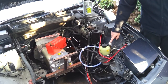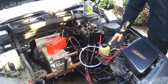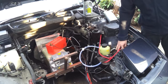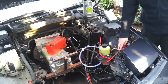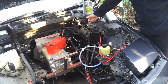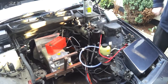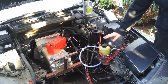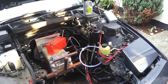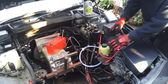I've also got a hydraulic pressure gauge that goes up to about 1600 psi on the high pressure port of the pump, so we'll be able to see exactly what's going on from a pressure perspective. I'm using standard hydraulic fittings and hydraulic flexible hose to bring the hydraulic fluid under pressure into the distribution block. The fitting into the block is 16 millimeter, so we've got a 16mm to 3/8 BSP fitting in there with a copper washer. So I'm going to go ahead, put some fluid in, start running it, and hopefully we won't get too many leaks.